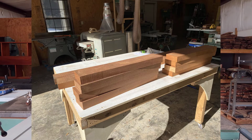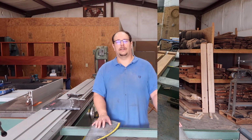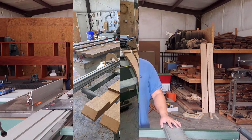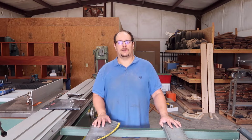Then went back to the table saw for the legs at the beginning, and then for the top. I mitered the corners for the legs and used a router to create grooves for floating tenons to reinforce the corners. Then I started to work on the stretchers. For the stretchers I cut dados using the table saw. Mitered the corners also. I assembled the stretchers to the legs using screws and washers, so I added threaded inserts to the legs to make sure the connection was secure.